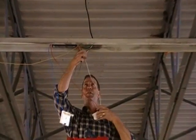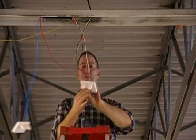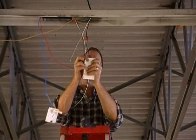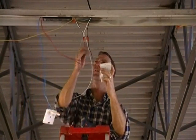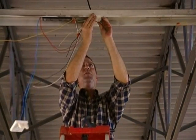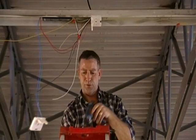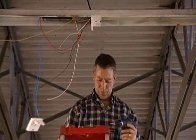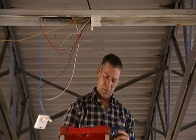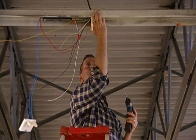Next, you'll want to be sure your wires are clear. Telescope out the socket plate to fit the channel width that you're dealing with. Then attach the plate using the self-drilling screws provided with the kits.